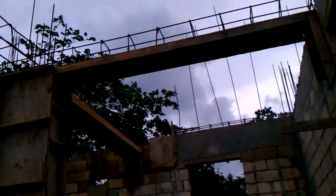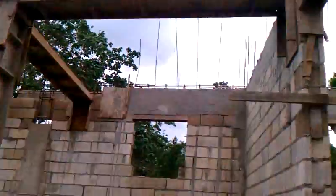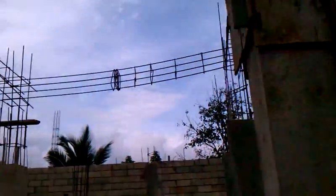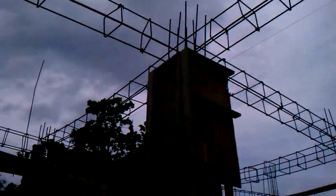We started boxing this up and we're going to continue boxing this up this week and pour it. We've done all the steel on the right wall all the way down to the end. You can see a lot of steel in this middle area — all these stiffeners here have steel, steeled up all the way across there, steeled up across here, down there, and across the second row. We only have basically that last row to steel up down here, these columns, and half of the second row. The whole first row of these stiffeners has been steeled up.